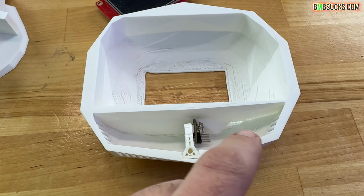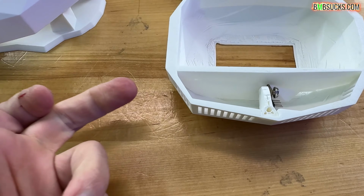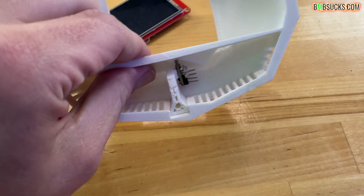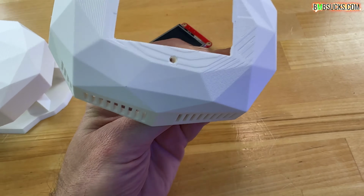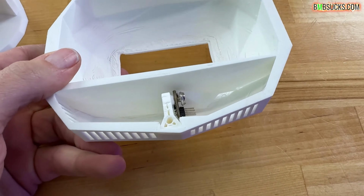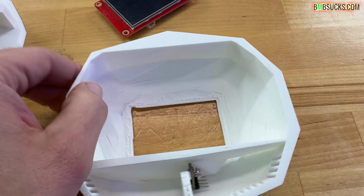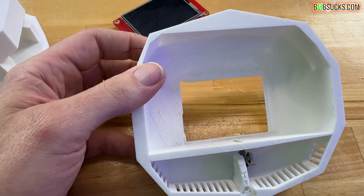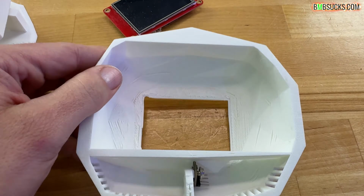And this entire chamber, I wanted to open it up again because I only have two sides. I wanted airflow to go from both sides and from the bottom, but nothing from the top. So that whole chamber is dedicated to trying to get the best temperature and humidity sensor reading that I could get. So that's pretty cool. It worked out really well for that, although I do have to make a new piece because that was too big. Obviously I had to trim it down, but I am learning things. When I made things too thin, you can kind of see my fingers going through there. Made it just a little bit too thin.